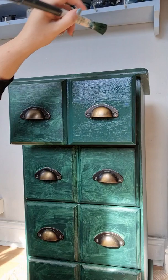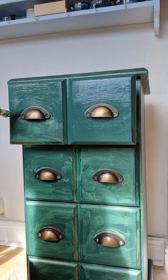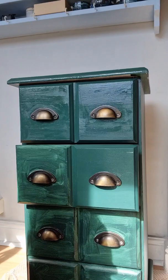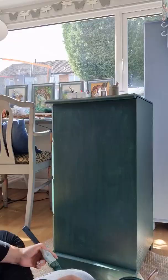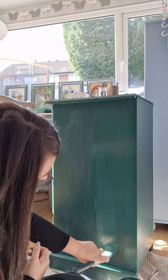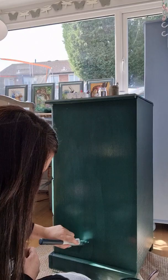The paint itself is a water-based paint and it is self-levelling, so it does all the hard work for you. This would be my second coat of paint — you can see the first coat underneath. I did eventually only do two coats of paint and three just on the top. This is a durable paint, but if it is a high traffic area like a table top I would use a lacquer over the top of it, which would just add that extra little bit of protection.